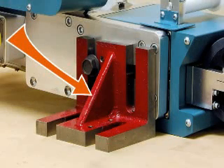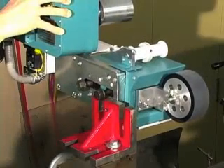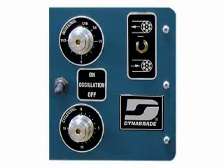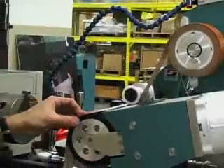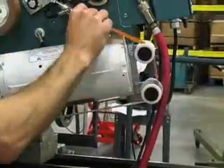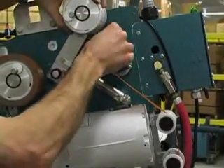The mounting bracket has a ground face making setups simpler and less strenuous. You can mount the Super Finisher to the lathe in less than 5 minutes. The control knobs for abrasive feed speed and oscillation speed have detents so settings can be repeated exactly for each setup, with less chance of accidentally changing settings by bumping the control. No tools are required to load the abrasive onto the Super Finisher. A simple system using pressure between the take-up wheel and the feed wheel makes the loading easy.